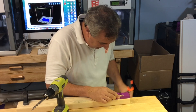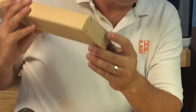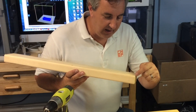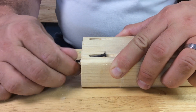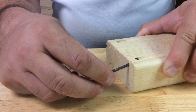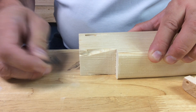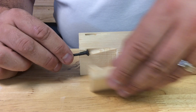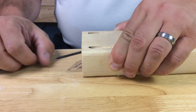This is working easy. Two perfect pocket holes, and it just comes out the end for the screw to go through. This is a total winner. I'll go to my scroll saw and cut a section so you can see what this looks like up close. Here it is with a screw going through it — it comes down like this and gets tightened up, comes through the end. It's going to tighten against the edge — that little hole left by the tip of the bit — and then the head of the screw holds it in place, giving you a nice pocket hole. It worked really, really well.